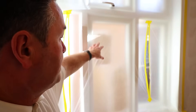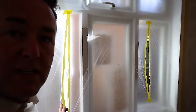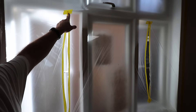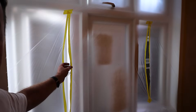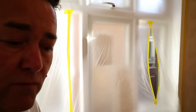Just before I put the mask on, I'm just going to tell you about this bagging. I've bagged up the window and you want some airflow from the window. Run a piece of masking tape just near one of the windows and cut down the masking tape — that will allow you to get through to the window to open and close it. The masking tape just protects that raw edge of the bagging there. You can see a little bit there to stop it flapping about and ripping the actual polythene sheet. So that is your top tip Tuesday. No tails on the spray practice there — let's get some spraying done.